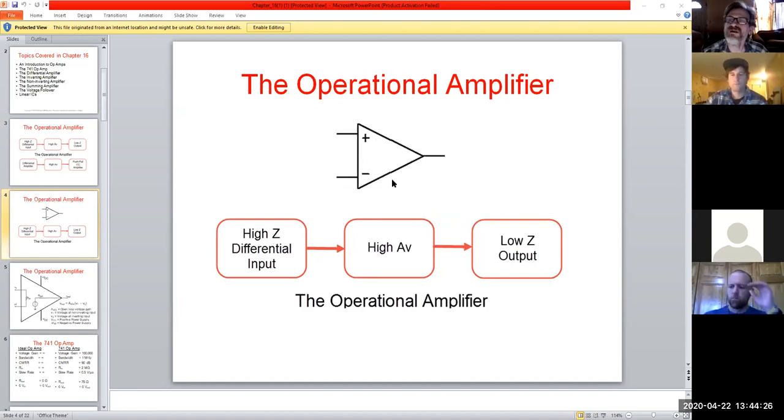Which is always, always, always, because here's the trade-off if we do Ohm's law with this. The voltage can vary, but if I had an infinite resistance or infinite impedance, what do you suppose happens to my current? Just for grins and giggles. Well, usually you have some kind of trade-off. So if we have an infinite resistance here, we're literally going to have a big fat zero of current. So your I plus and I minus always equal zero. If you tried to put a meter in line and get a current reading out of these, you're not going to see anything.